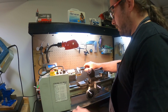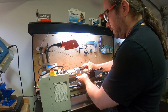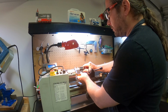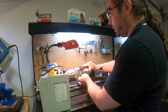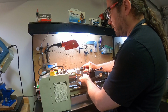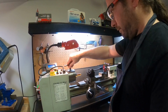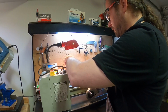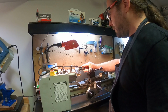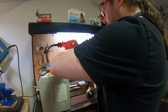I'm not going to include this crap area, so I'm going to come out at least that much. Now I'm going to take way more than that just to be on the safe side, in case something gets screwed up and I don't rechuck. 19 is bare, but I'm probably going to go to something like 28. This does not have to be precise, but that gives you an idea as to the kinds of things you think about when you're trying to set this material.